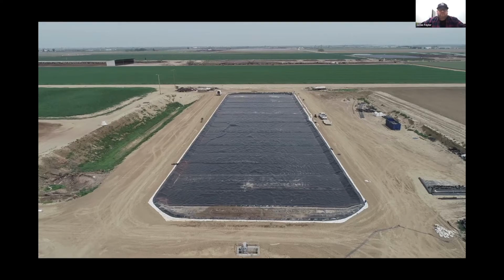Some piping, influent and effluent that may be existing and entering the lagoon at a higher elevation simply just needs to be turned down to where it can follow the slope down to the low water level. And once it's below the liquid, then we have that seal and we do not have to worry from there.